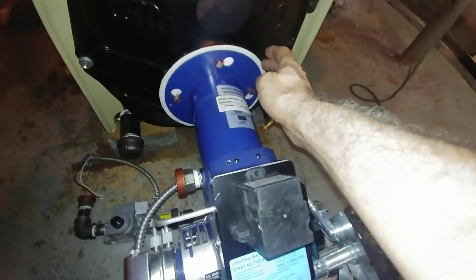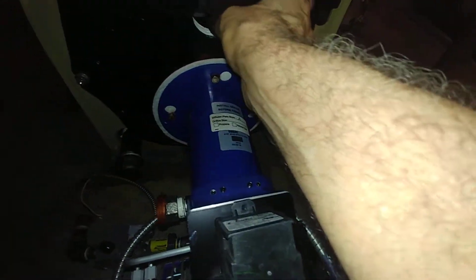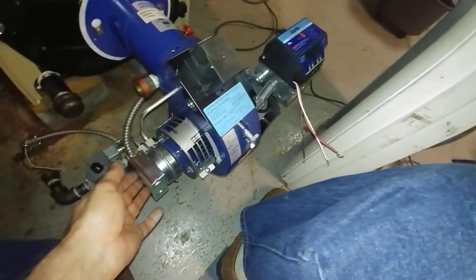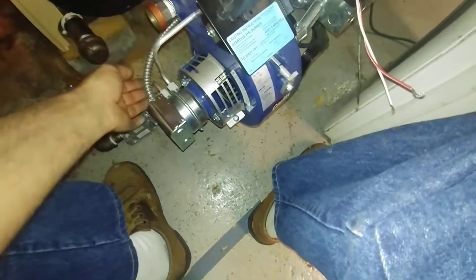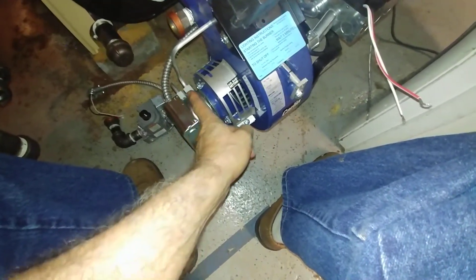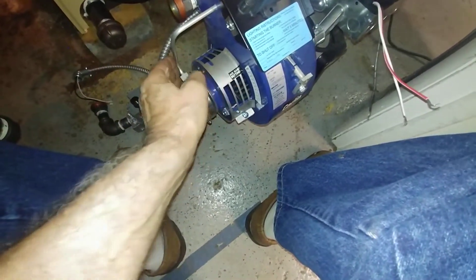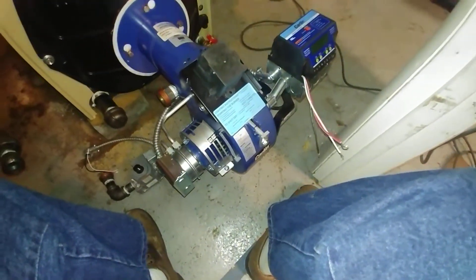This is the proving switch. These are air tubes which go across a differential diaphragm, and here is a little micro switch. When there is proper airflow, the diaphragm moves and turns on the switch, allowing the flow and the firing to continue.